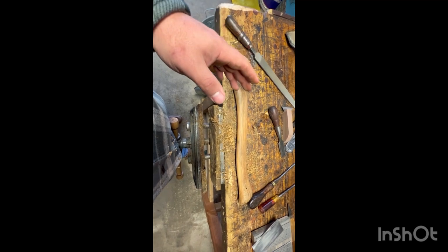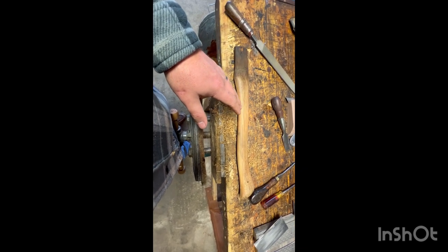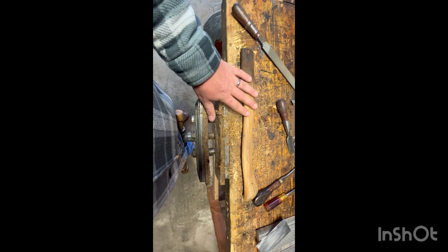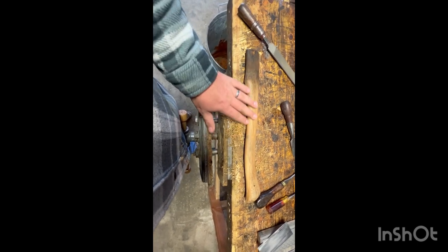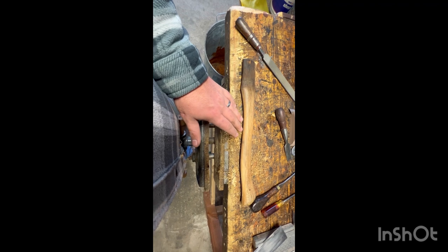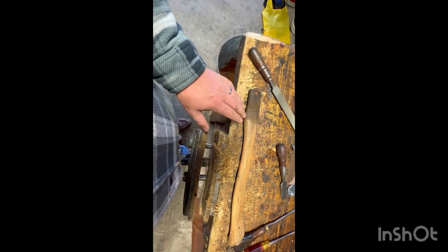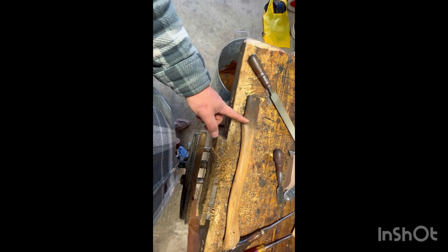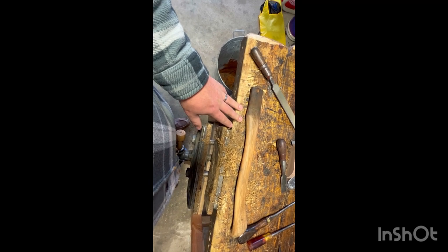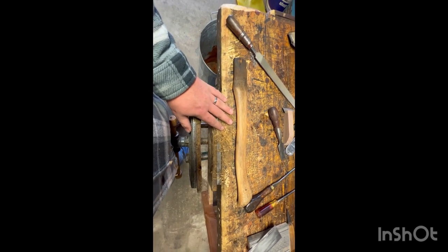So what I'll do now — sometimes I'll use 150, depending on the wood. This was so weathered that I'll probably just use like a 220 on it and actually rough up the outside of it a little bit. I'll just go over the whole thing with 220. Then I will add my finish to it. Up here at the top, I haven't touched any of this because the head was sitting up about this high, and I'm going to bring it down closer to the shoulder. So I'll be using a spokeshave on all this, and that'll be our next video. Let me get some sandpaper and rough this up, and then we'll look at the finish on it.